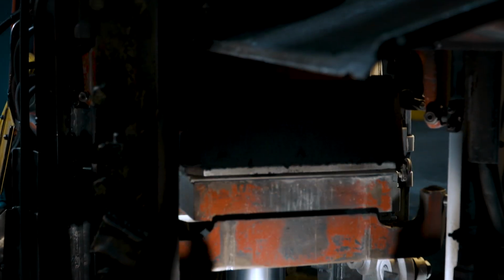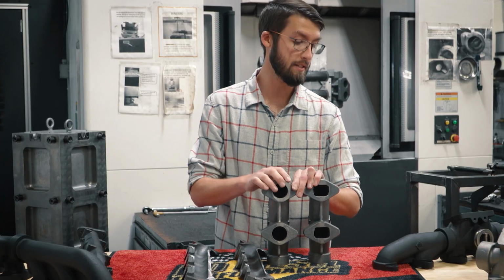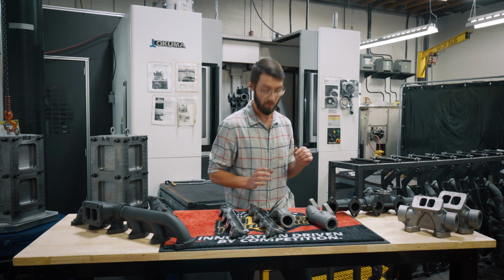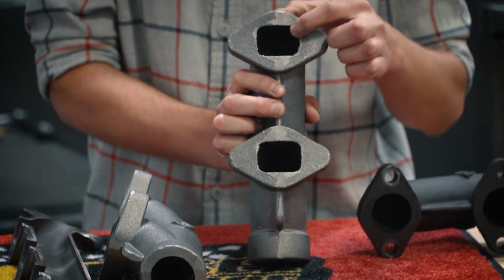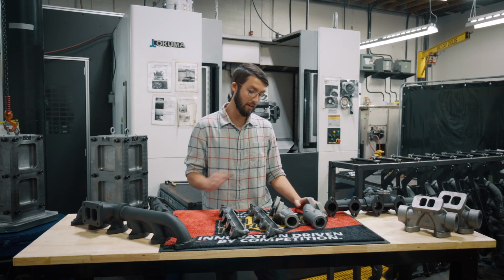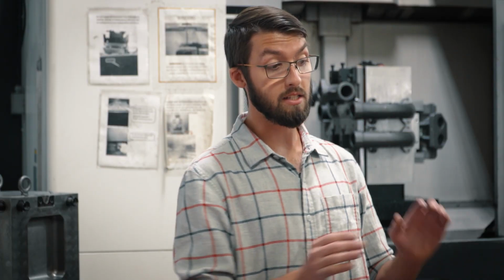In front of us here, we actually have the common rail 24 valve casting or the 12 valve casting. The other interesting one is our port match high flow T6. A little bit of the differences on these guys, these are specifically cast to be port matched. On our high flow guys, in case someone ports the head, we actually gasket match on our high flow T6. As you know, there's different kinds of inlets and different kinds of outlets. These are set based on the turbo you have or your application. It's between those two ports where the magic actually happens.